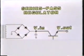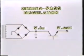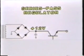This is known as a series-pass regulator circuit. In the series-pass regulator, the unregulated input voltage is connected to the collector of the transistor, and the regulated output voltage is taken from the emitter. In this circuit, we're trying to obtain an output voltage of exactly 5 volts DC as a power supply for the game's computer. The input voltage at the collector of the transistor is around 12 volts DC. The input voltage of a regulator circuit is always considerably higher than the output.